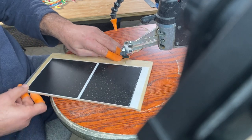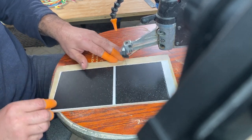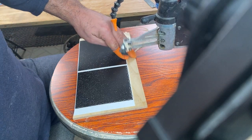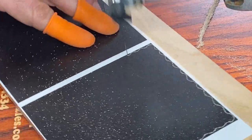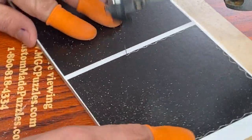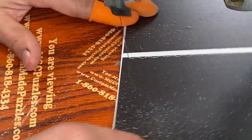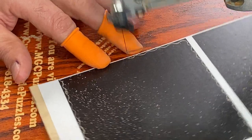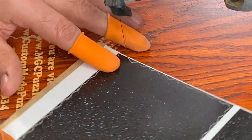This is how you make a scalloped edge. It's just a nice, steady, even pressure, and a very almost clock-motion pendulum, a rocking motion of the wood as I'm rotating it. I refer to this as scallop cutting the edge, and it really gives a finished puzzle a really beautiful look. The scallops can be bigger or smaller, just like the waves in an ocean — it doesn't need to be any specific style, but it's probably best to try to keep it as uniform as possible. Practice on a little bit of scrap wood in the shop if you like.